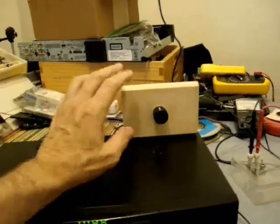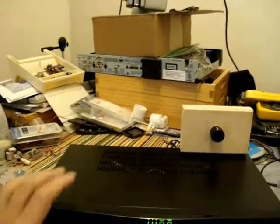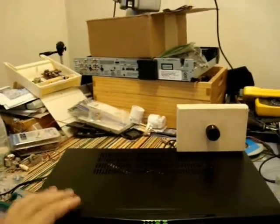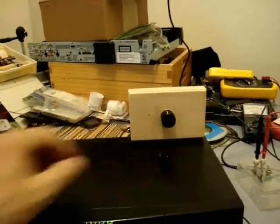This is actually what I did to the modification afterwards for tuning the antenna and making sure it's tuned right. That was one of the deficiencies I found in this unit. The auto-tune doesn't always tune at its best peak performance, so I added this control to actually peak the signal.